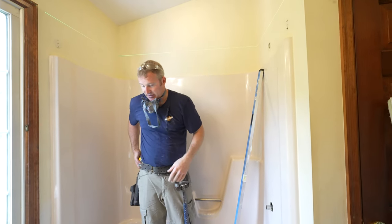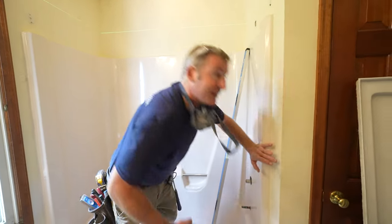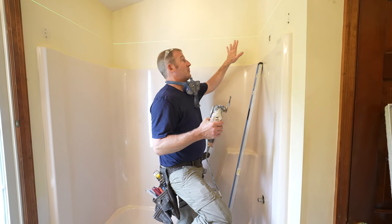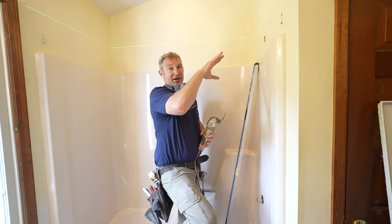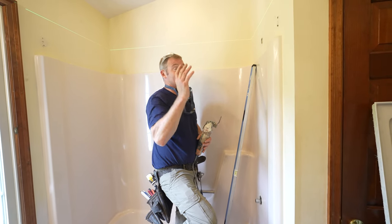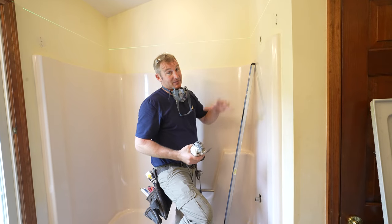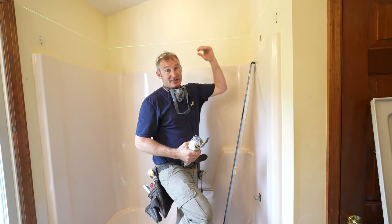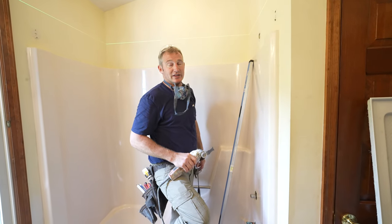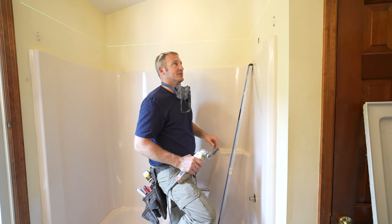We've got 84 inches for our cut line, and we're going to use an oscillating tool. You can use a sawzall, but this is going to be more precise and a little bit safer. I don't foresee any wires necessarily behind here in this situation, but you have to be careful — a lot of times electricians will just run wires behind the tub surrounds, so there could be loose wires back there. Also, if you're on the first story, there could be water lines feeding up to the second story. So you don't want to just dive in and cut too deeply into your stud bay — you want to be delicate until you get that drywall out so you know what's going on.